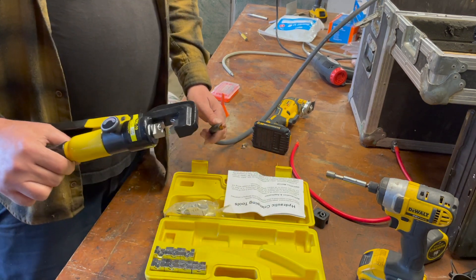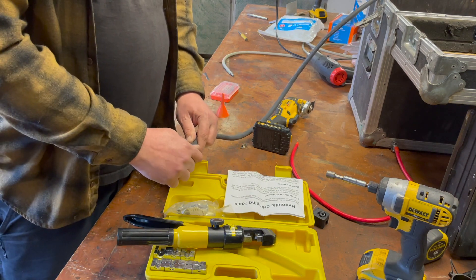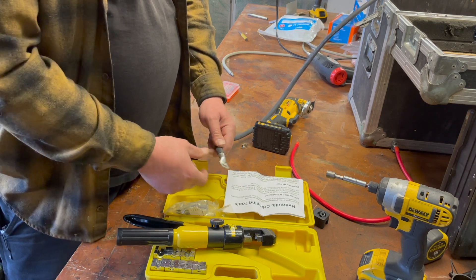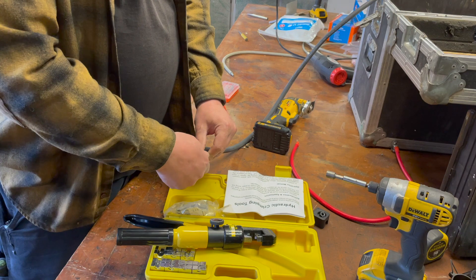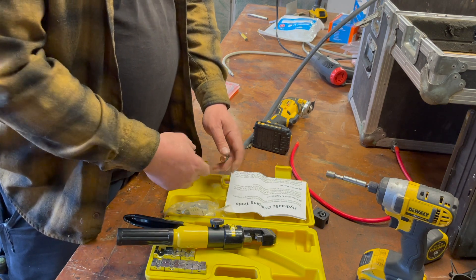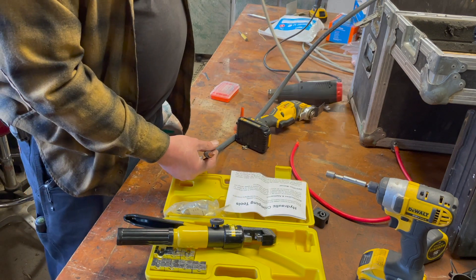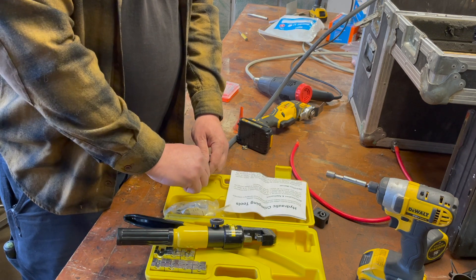I went ahead and bought this tool. I'm a big fan of quality tools, and I'm also a big fan of cheap tools if you're just going to use them occasionally — and this falls under the cheap, occasional-use category. It's a hydraulic crimper and it's going to crimp these lugs on. I've stripped the insulation off just using my pocket knife. The reason we're using welding cable is because it has a very high strand count. I considered using some other wire from the recycle yard but it only has six conductors and it's very stiff, so I relegated that to other duties.